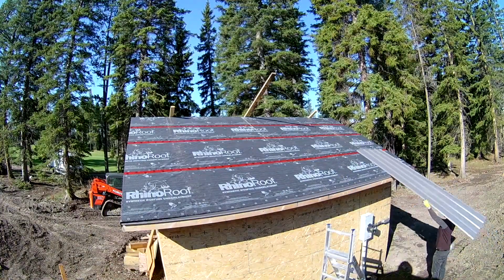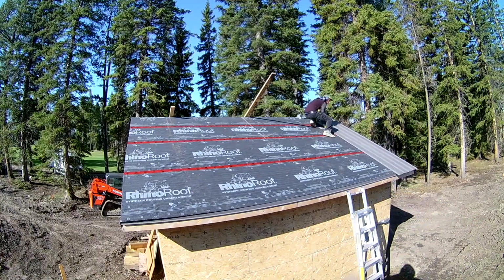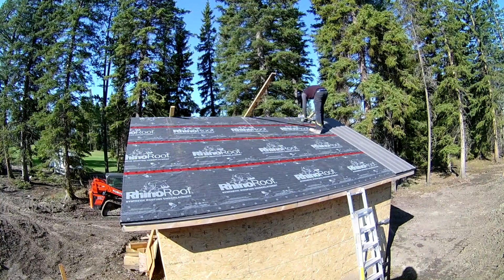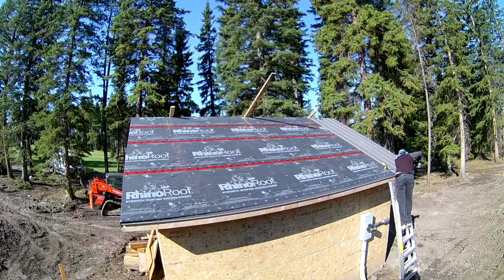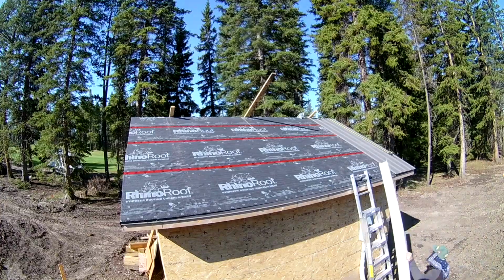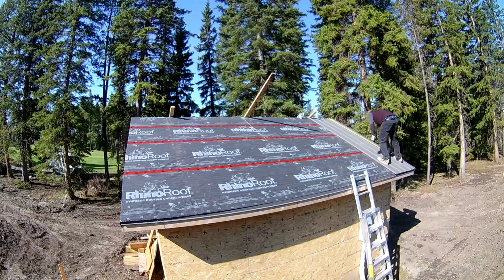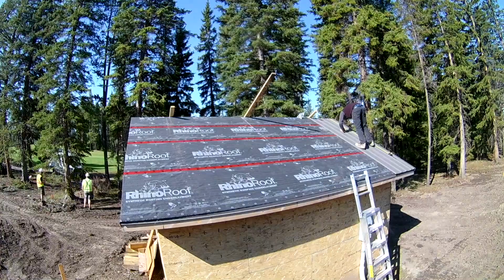Starting with the first sheet, line up with the gable end, making sure the bottom is overhanging past the drip edge by 1¼. Hold the piece with 2 screws and check with the tape measure that the panel is square and parallel to the other gable end. Now I will fit the gable end trim over the end rib and fasten with 1-inch hex screws with neoprene washers.